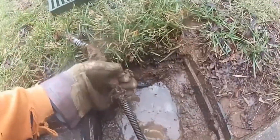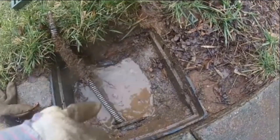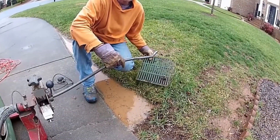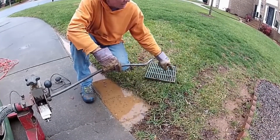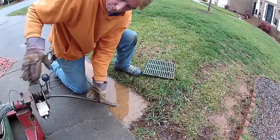The cable went all the way under the drive and you can see all the tree roots — take a look, a pretty fair amount of tree roots right here. So we'll clean these roots off, then pull this cable back and do it again. This time we'll run water through there. The cable does a great job of cleaning out the line and grabbing all the tree roots, even finding broken sections of pipe, but you need the water to push out the debris, mud, things like that. The cable opens the line and the water cleans it out.